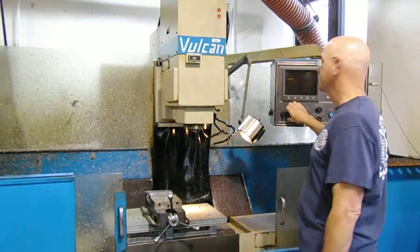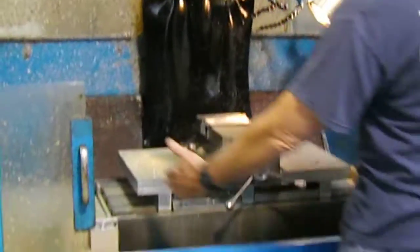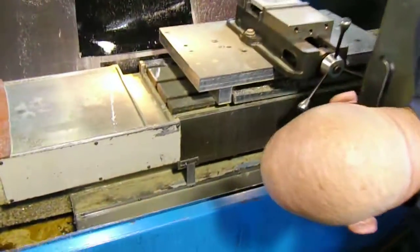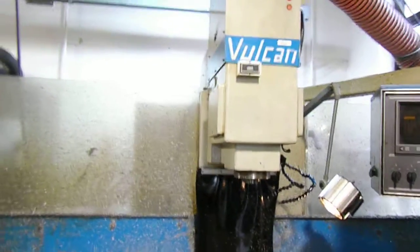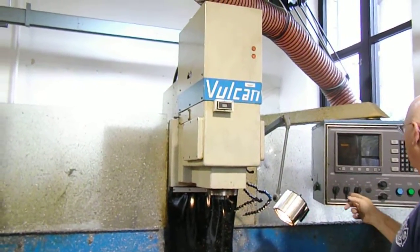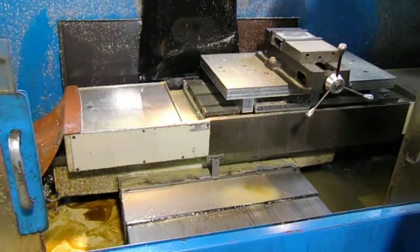You can just tell it — it says 'I lost my power, I've got to send you home.' Home the machine. Home position is all the way to the right, with the pointer lining up with the mark on there. The head all the way up, then bring it down two tenths of an inch. On Y, all the way to the back and then two tenths of an inch in. So you've got to home the machine.